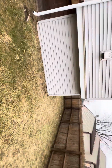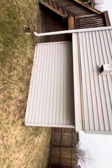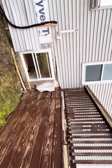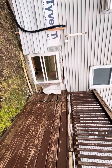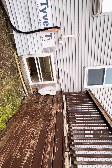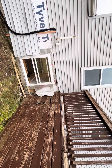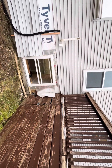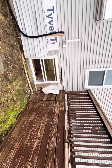It's almost over there. It's kind of because underneath this is not insulated, so any piping you would try to bring out here would freeze. The only thing you could do is shift it out. Actually, the best place to put it would be right where we're at now, to come right through that wall above that dryer vent or something like that. And I guess that's in the laundry room. That wouldn't be too big a deal to do. So if you want to think about that, just to keep people from all of a sudden getting all their junk underneath there and then leaving it when they move out.